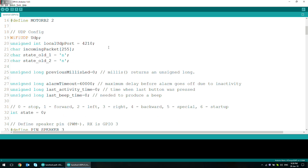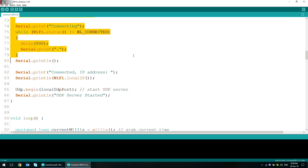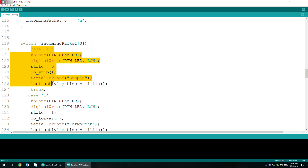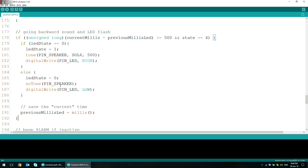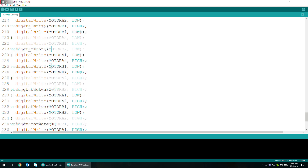The second source code is for the robot car itself. This is the definition of pins for the H-Bridge. On startup the car will try to connect to the access point. Once connected, it will start the UDP server. The loop function checks whether a new UDP packet was received and executes a debounce routine to check if the new command matches the two previous commands. Once validation is passed, the code executes a command based on the string received via UDP. These lines define how to beep and blink with the LEDs when the car is reversing. There is also an alarm in case the car is inactive for too long, and functions that define what pins to change on the H-Bridge when a new command is sent.